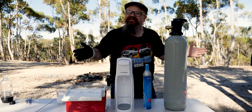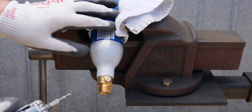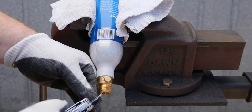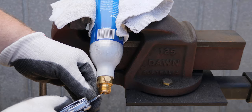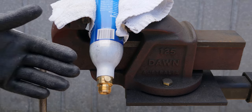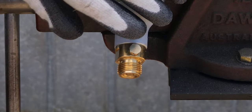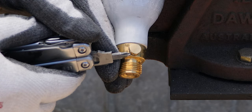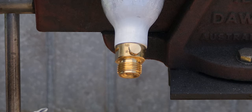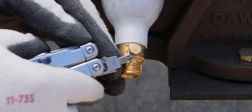To remove the valve assembly from the bottle we need to make sure it's fully depressurized first. We press the valve at the bottom — I'm wearing gloves because I don't like frostbite. This is the burst valve, and right at the bottom there's a tiny little hole for pressure to escape. If we get an overabundance of pressure inside, the burst valve releases it.